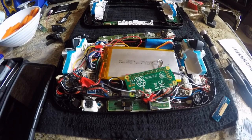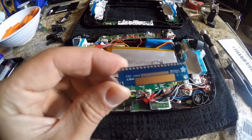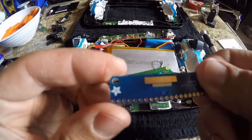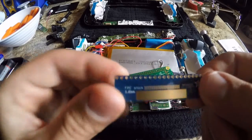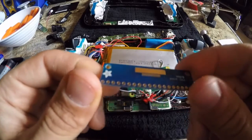So yeah, it's quite the mess, but everything fits — it's very tight but it all fits. The only thing I'm missing here is my HDMI out. There is the inside, and these boards right here are actually from Adafruit. On one side I have the controllers for the joysticks, and on the other side I was able to put this ribbon connector on. With all this done I can fit everything all on one board — half the pins are used for the joystick, the other half are used for the buttons. This board is amazing, works out perfect.